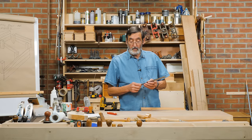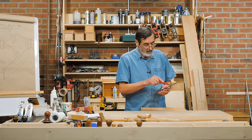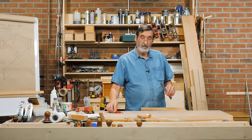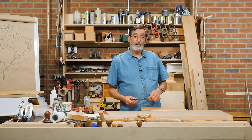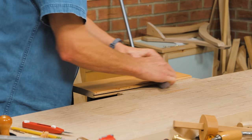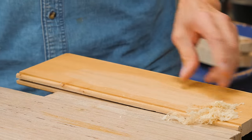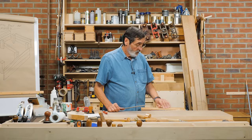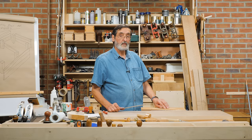Here's a trick you may not have seen before. Because I use a knife against the edge of my steel rule constantly, it creates a very fine burr on that edge. If I'm away on a job, I've got a ding in a piece of wood, and I don't have a scraper with me, I can take the edge of the ruler and use it to take shavings off the wood — just like that. It's a perfect way of getting that ding out of the piece of wood. I love that trick, I've used it all the time.